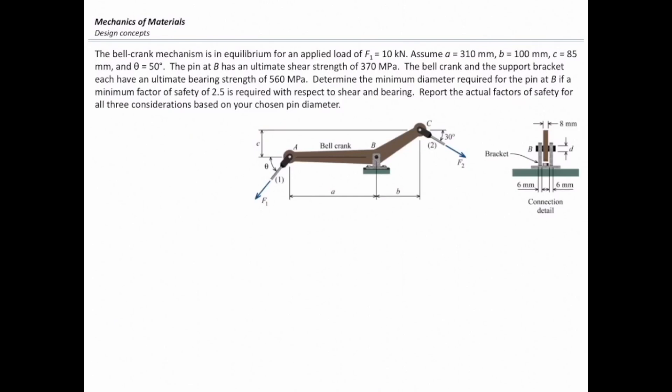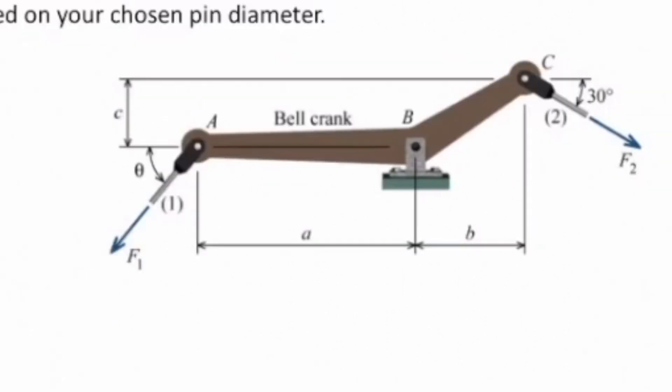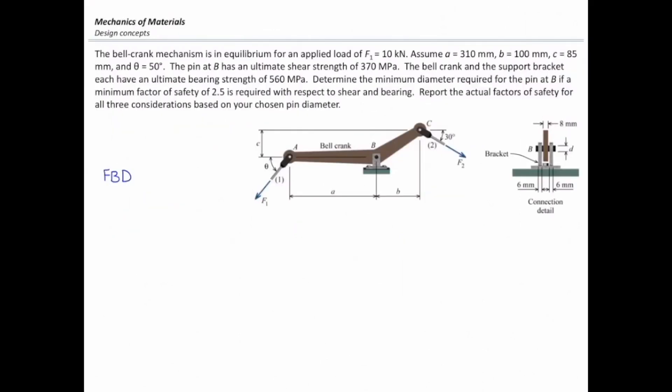In this problem, I want to use almost everything that I have learned before, mostly determining stress. The first step is a free body diagram. I want to make my element free. The only thing that restrains my element here would be a pin at B, so I will release that by putting two unknown forces there.